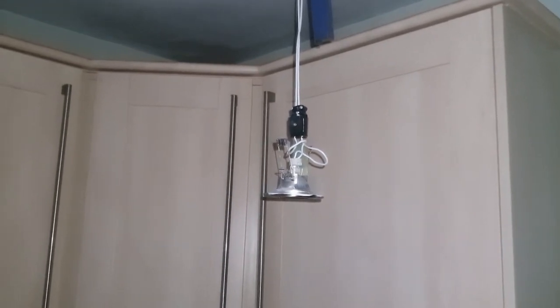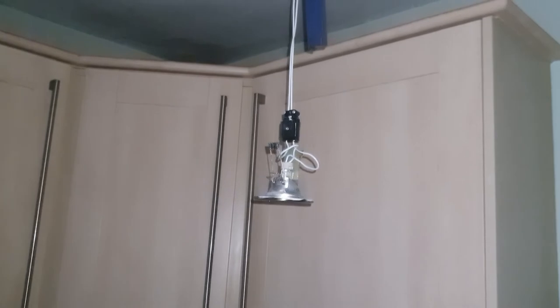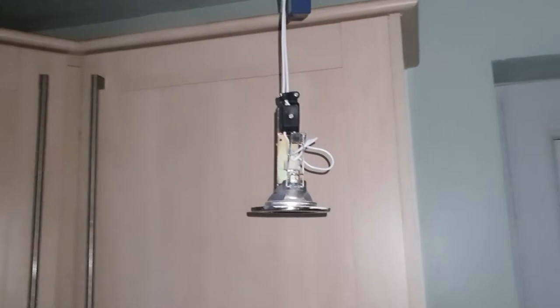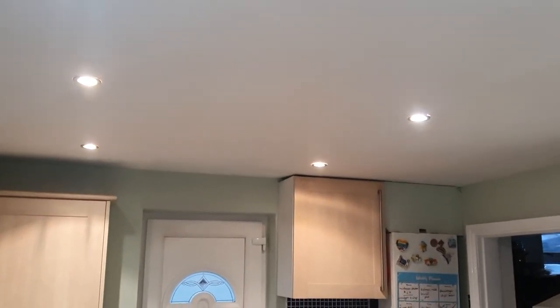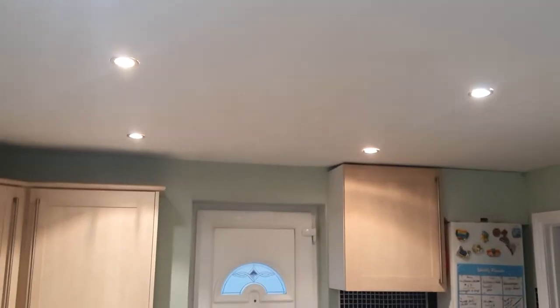It's as easy as that — a five-minute job. If your halogen light bulb change doesn't work, it's likely the transformer, and it's a five-minute job. As long as you do it safely it is very simple and cheap to fix. There we go, all back up. All six on this strip are working, and four on another connection over here. Take the right safety precautions, make sure your electricity is isolated, five pounds for a transformer, a couple of screwdrivers — it's as easy as that. Hit the like, favourite and subscribe, and I'll see you on the next one.